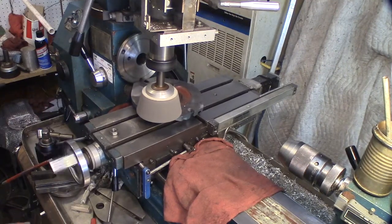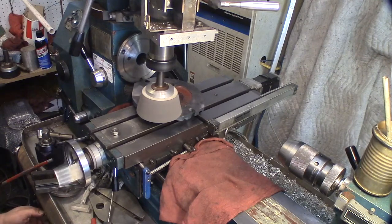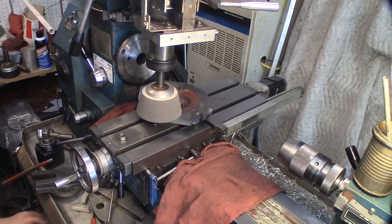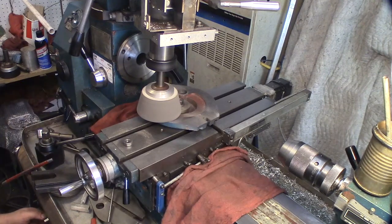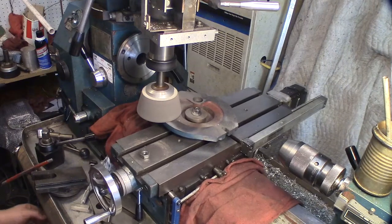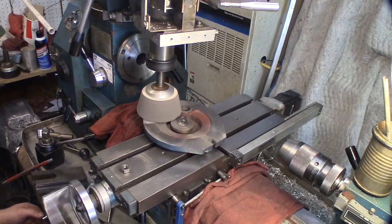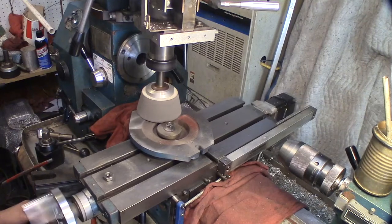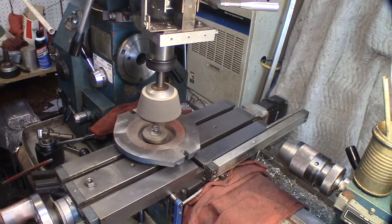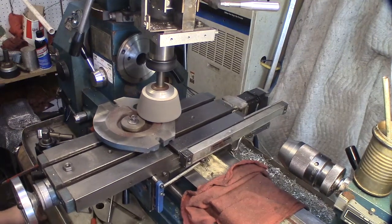So while that has its place, I'd like to expand my capabilities. I'm going to make another arbor to use with six-inch benchtop grinder wheels. The arbor is going to do two things: it's going to allow me to grind in a side position — I'll just have to put things on an angle plate on the table to get some semi-precision grinding for a thing I need to do with one of my chucks — and I can also just turn it sideways, stick it in a lathe, and use it with a diamond point to shape and true up my wheels.